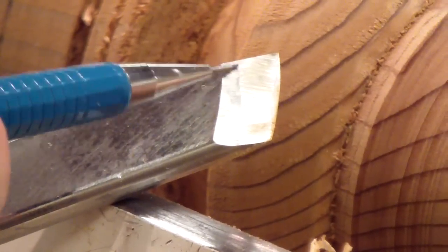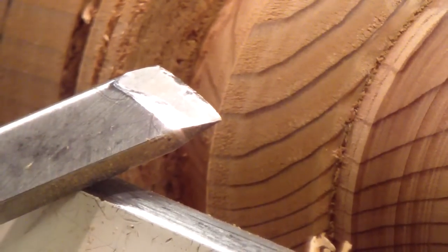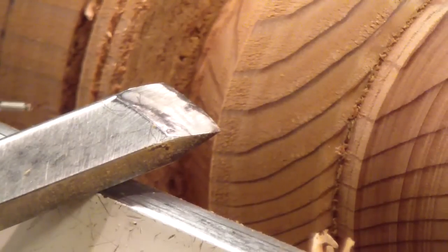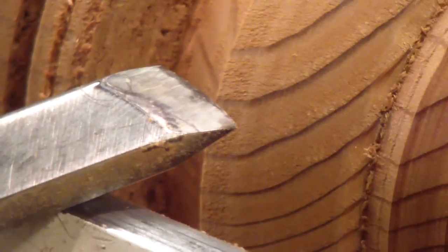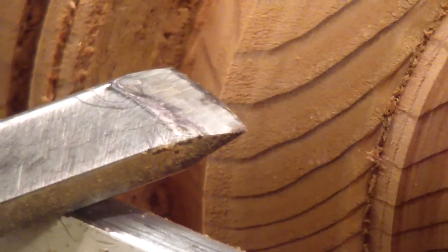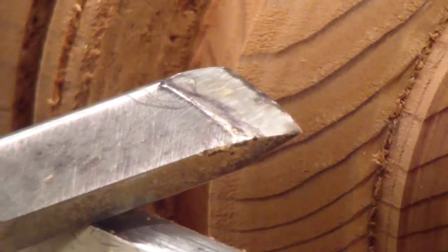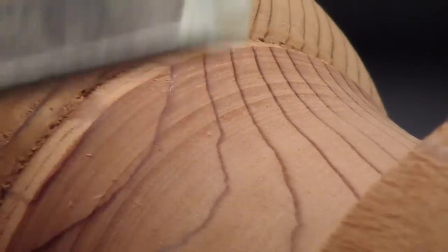Right up here should be ground away, and down here if you're going to use the concave cuts. This is only just barely ground away. See that? It's been chopping and chopping and chopping. It would have been ground clear back to here if it was proper. Again, it has nothing to do with the functioning of the tool. It's just scarring up your stock as you go. And because this was still here, I wind up with a little bit of ridge work in here. See that right there? I had to keep this up, and therefore I'm unsteady.